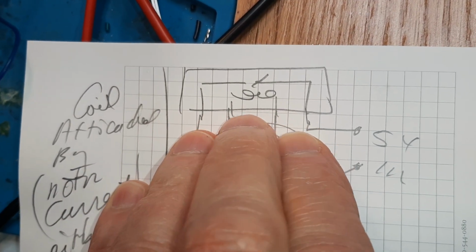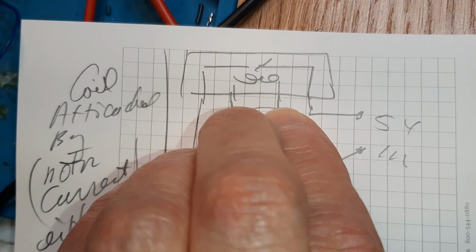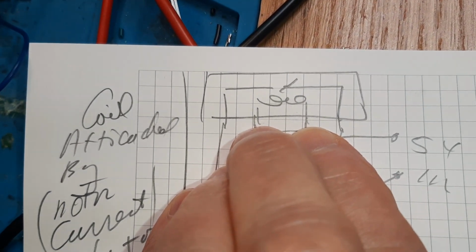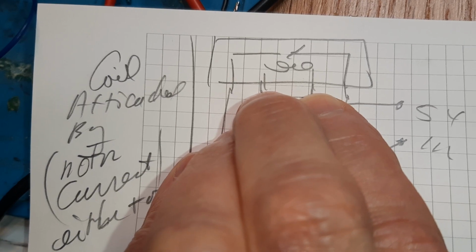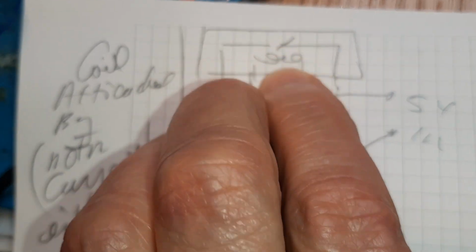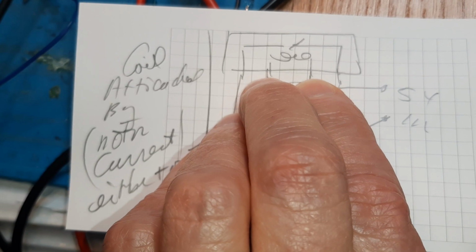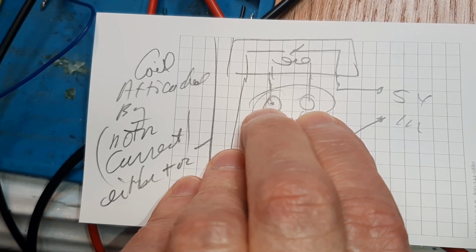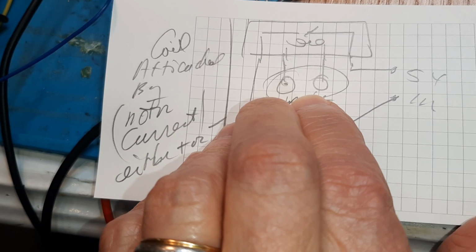So what you do is you take these 2 pins in the middle and you run some juice through them. And every time you run juice through that, this relay is connected. And the beauty is I could order it with or without a diode, which would specify positive or negative current flow. I ordered it with no diode, so that energy in either direction, positive or negative, would cause the relay to trigger. That means if I hook up my brush connectors off the motor to this coil, anytime that motor is turning in either direction, this coil will be magnetic, and the field will pull in the relay regardless of direction. Got it?